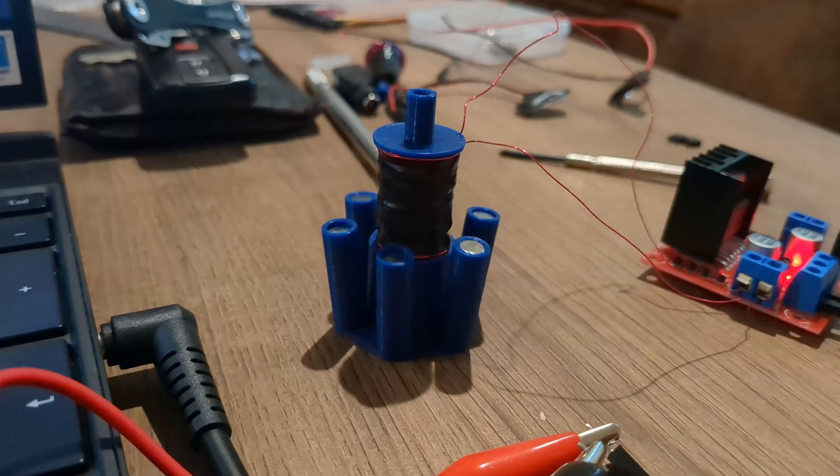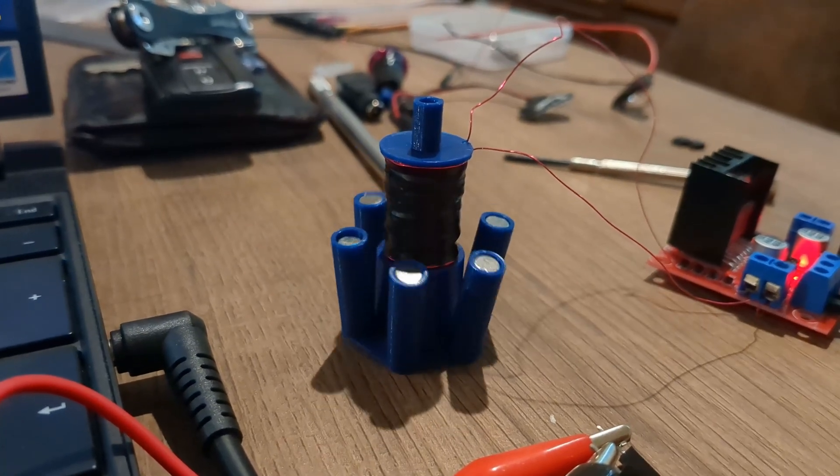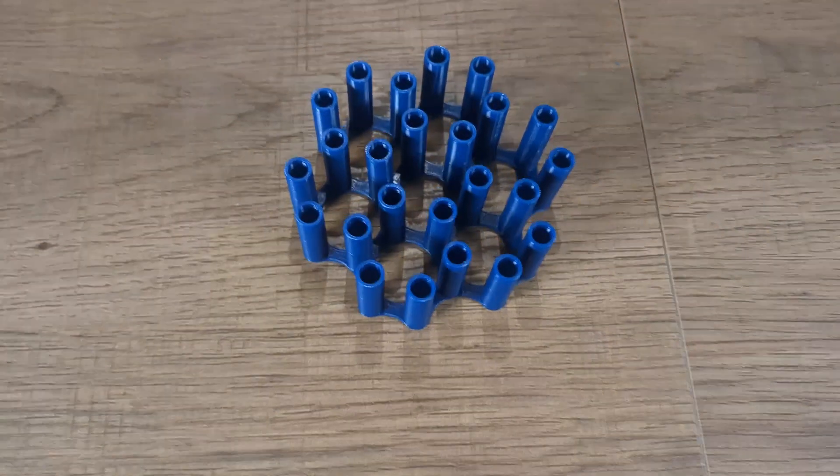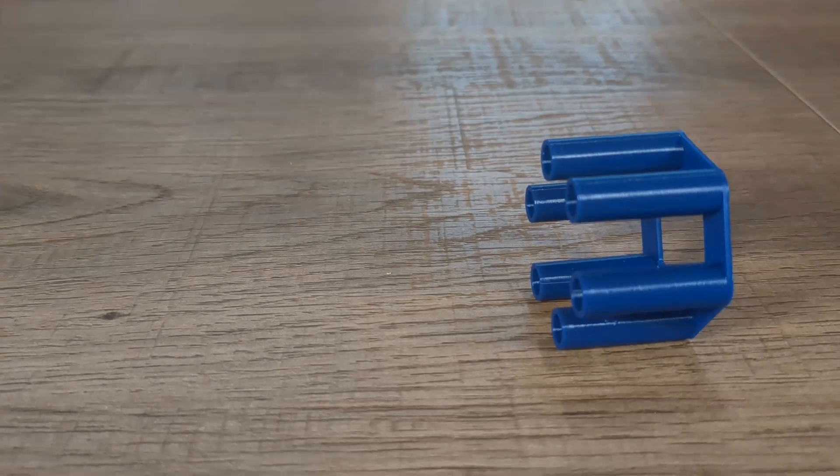In addition to Lynette being relatively quiet, Lynettes can be both parallelized and serialized. For greater pulling force, you parallelize them. For longer stroke lengths, you serialize them.